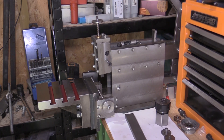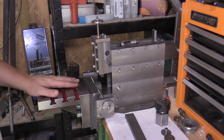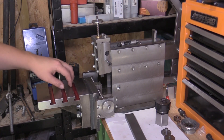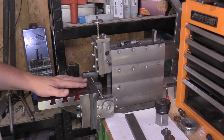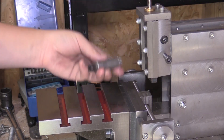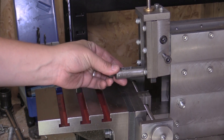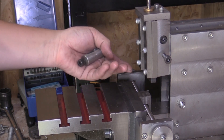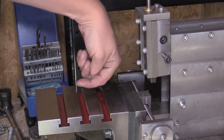Since the last time you saw this manual shaper, you'll have noticed I now have an angle plate on here which effectively gives me a bed with T-slots in it, which is a much better surface to work on. Originally I made the steel holder which screws into the head and you can put a bit of tool steel in vertically to cut the top face, but that's not going to work for splines and keyways — we need to be able to cut inside.